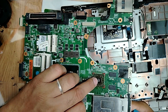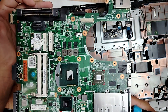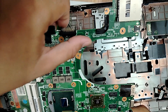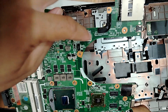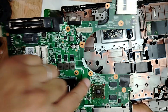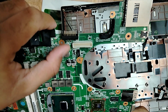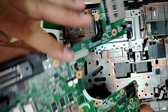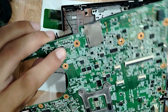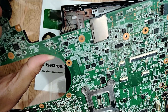Let's heat up the graphic card and recheck again. I hope we can fix the problem. Also the LCD circuit should always be checked with this problem - it could be the graphic card, the CPU circuit, or the LCD circuit. Always check components on both sides. This diode is good, everything is serviceable. Let's heat up the graphic card and see the result.